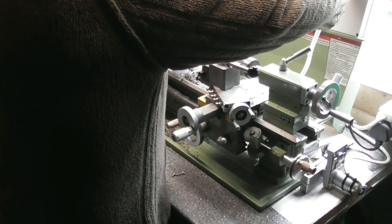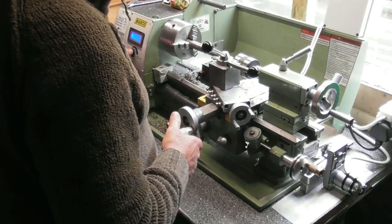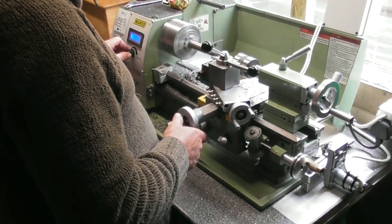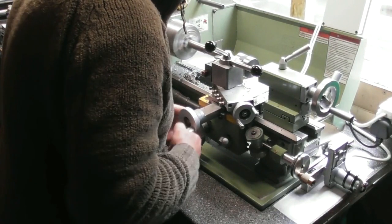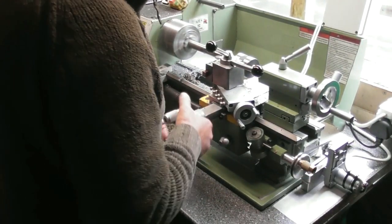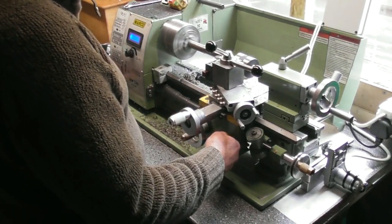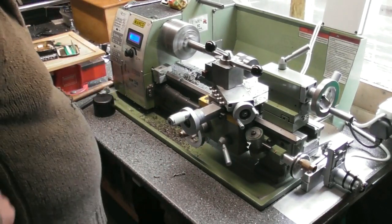Yeah. About half speed. We'll start the lathe up. Let's say about 1000 RPM. It's about 20 mil diameter. I'll just touch off. There. We'll be kind to it. I'm going to give it a 0.1 cut. That's 0.2 off the diameter. Gauge the feed. And off to go.